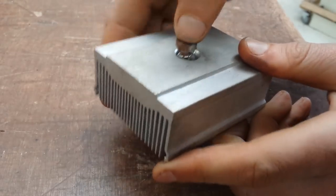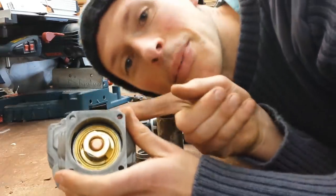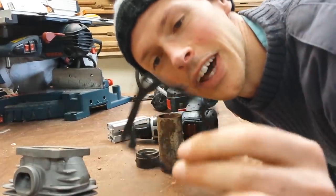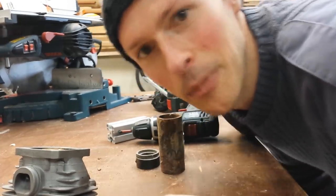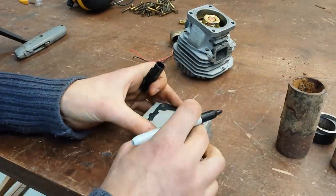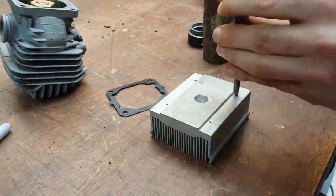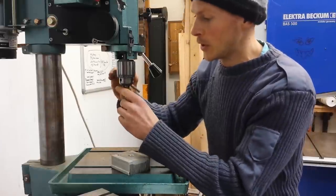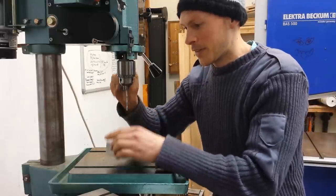Back to the hot side riser and the hole we're making in it. This bolt's going to fit quite nicely — it's a bit rough and we'll need some rounding off. I was really struggling to scribe down through this cylinder to accurately mark out these four holes, and then I remembered that I have this gasket so I can use that to mark out. Otherwise it would just be a question of measuring and marking out the old-fashioned way with calipers. So we're all marked up and ready to go — we're going to be drilling a 4.2mm hole, which is of course for an M5 thread.